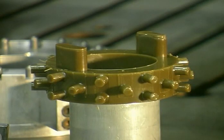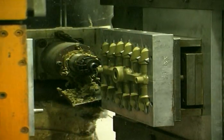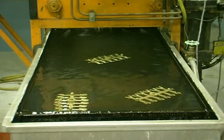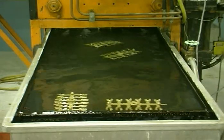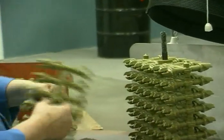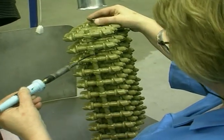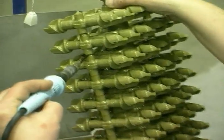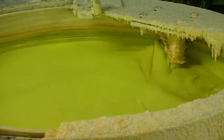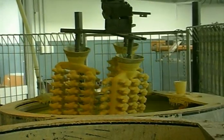This is the precise shape of the final product. These cutter bodies are required in large numbers, and so the wax injection process is automated. The waxes are ejected, the die closes and the cycle recommences. The sets of waxes are carefully checked and trimmed, and then assembled on a tree. The segments are welded together, thus forming a runner system. The waxes are first coated with a very fine investment to give good surface detail. It is subsequently built up with ten layers of zircon sand, using a silica binder.